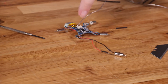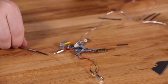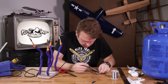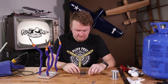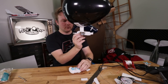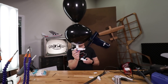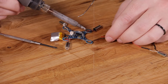Be sure to pay attention to the wire colors — red or sometimes white usually means positive and black is always negative. If you accidentally solder the wrong color wire to the wrong pad on the PCB board, it's not the end of the world — it'll just cause the motor to spin in the opposite direction. So if you have trouble when you start trying to fly, keep an eye on your motor direction and which way the thrust is going. If you find the air is blowing in the wrong direction, first check that you have the right prop on that motor. If it's still wrong, that means the motor is reversed — to fix it, simply unsolder and swap them on the solder pads and re-solder them down.